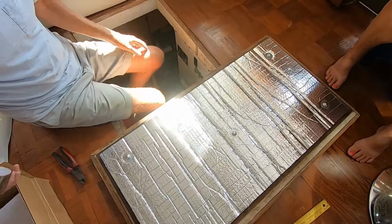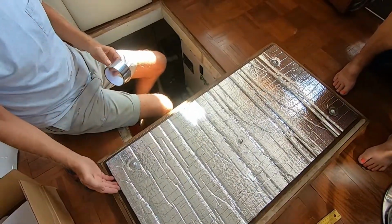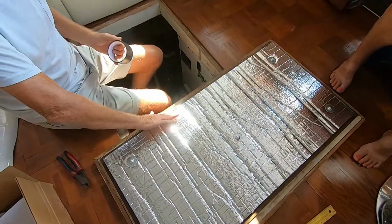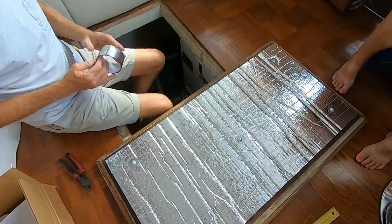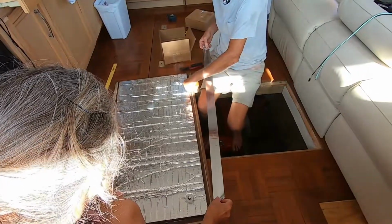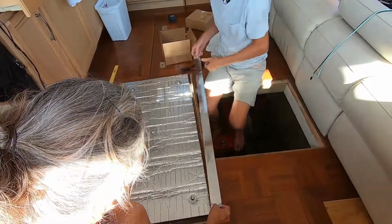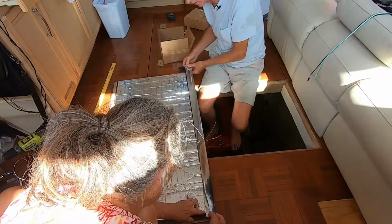There's one more thing you got to do. The last thing is we're going to tape up the edges, and that protects the edges, also helps keep sound from going where you don't want it going. Alright, now what you want to do is you want to take this tape and put about 1/2 inch on top of your soundproofing. And you want to be hanging over both ends.